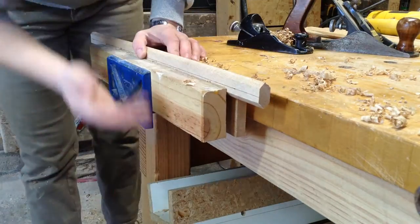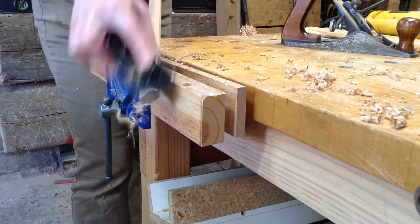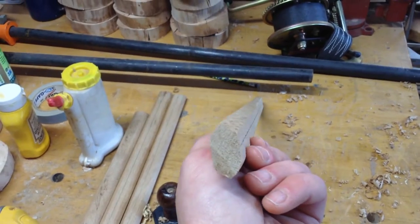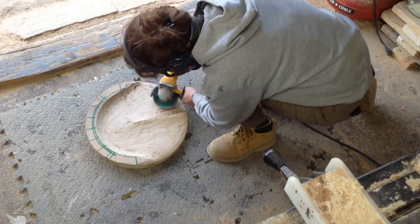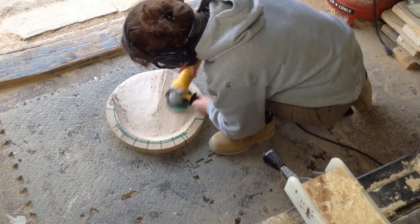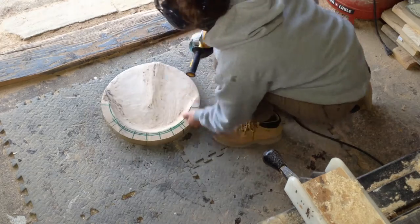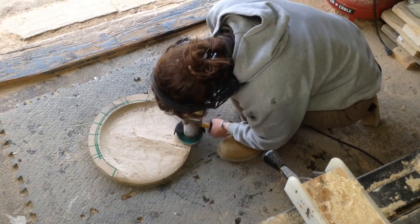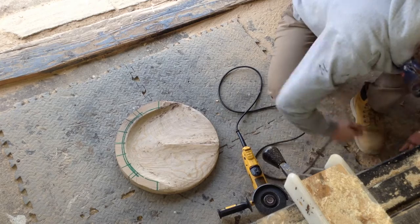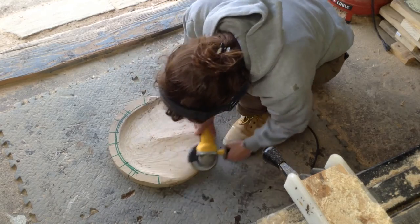I made seven of these and made them oversized so I'd have plenty of material in case I miscut anything and wouldn't have to completely remake the rails. I continued working on the seat — sanding and carving. There's a peak in the center, then it splits for where your legs will be, and a nice rounded portion on the back. Once I was done with the abrasive disc I switched to a sanding flap disc in the angle grinder, which cleans up the oak really nicely — takes down the material and smooths it out.